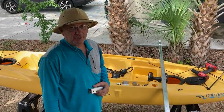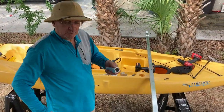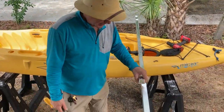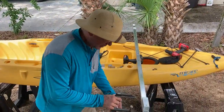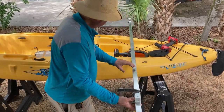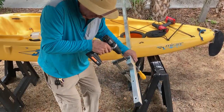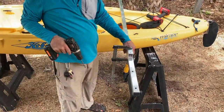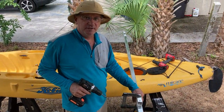If you don't have a drill press or a drill guide, I provide you with a guide in the kit. You clamp it down or tape it tightly in the area where you want to drill the hole. Since this guide has a hole in it, you just line it up and drill your hole through the cross tube or the runner rails — and you'll have a straight hole without needing a drill press.